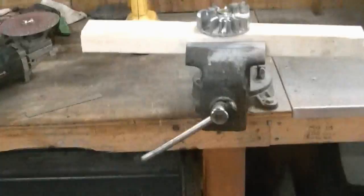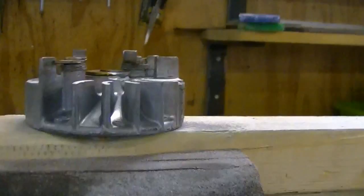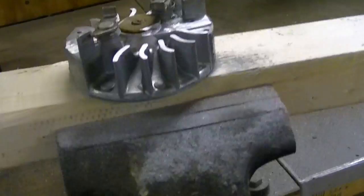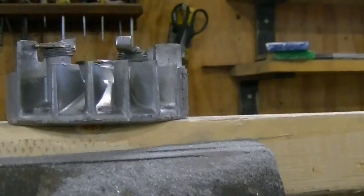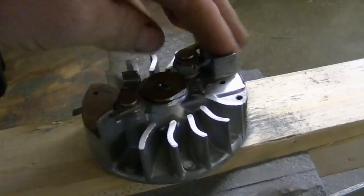See, now that's the way I should have done the other side. This flywheel's not ideal, but you get the idea — nice and flat, or fairly flat. You leave these two pawls. If it's a weed eater that doesn't require those, you can take it all down flat. And that lightens it up quite a bit.